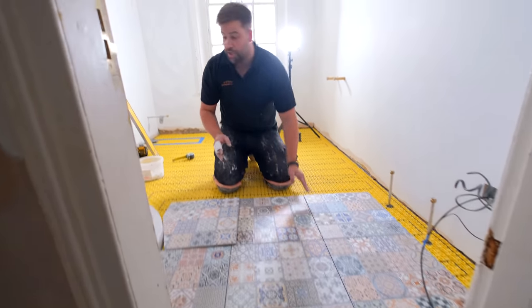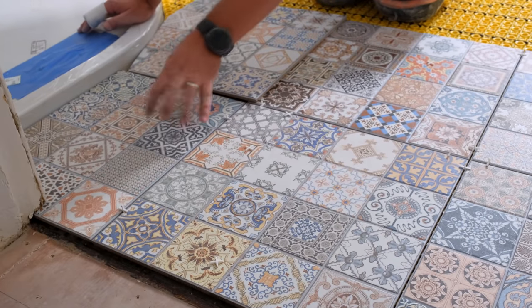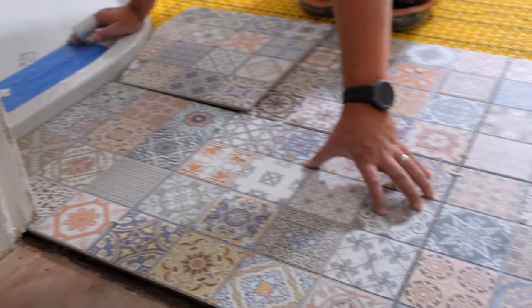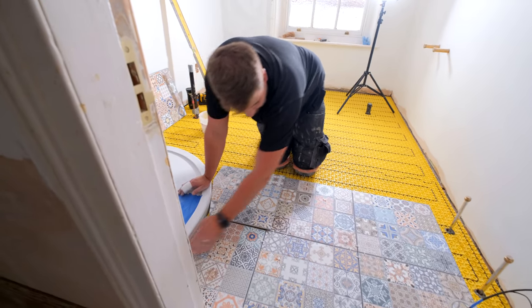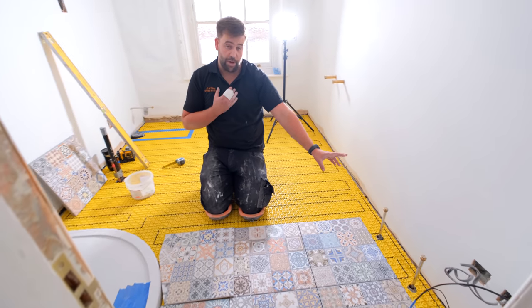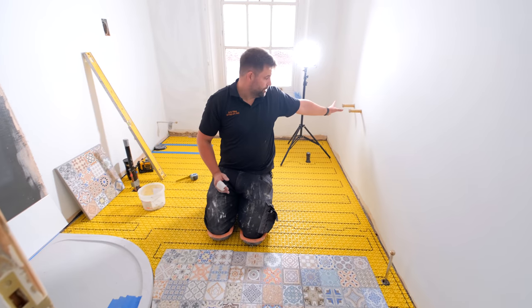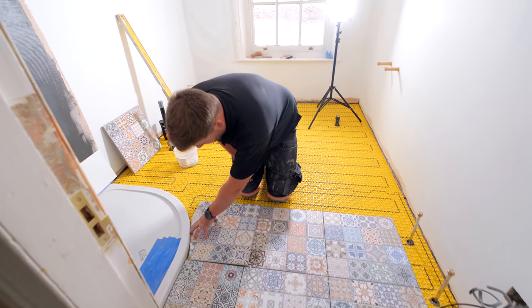So it's about halfway underneath the door, which is what I'm always aiming for, between 15mm and 22mm underneath the door, which is good. So what I've done, I've cut one of these sides off a tile, so I've got three panels left rather than four. Put that against the tile here, so that's given me enough fat over on this left-hand side, for where the tile rake is going, obviously the rip down here underneath where the baths go. Which has then led me to this.